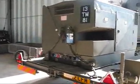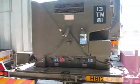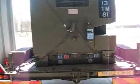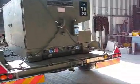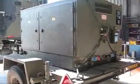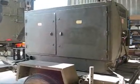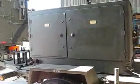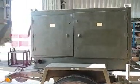The diesel generator is much more economic to run than the onboard petrol generator. The diesel runs at 1500 RPM and not 3000, and will run all day on agricultural diesel which is much lower in cost to buy — and that's quite legal, running a generator on agricultural diesel.